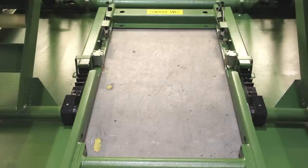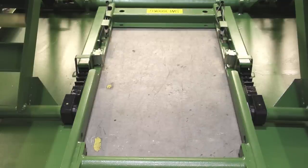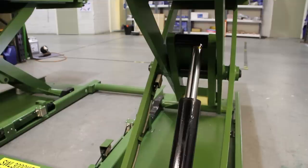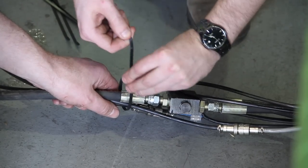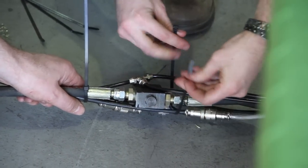We're now going to take you on a quick tour of the safety systems of a Clifton lift. You can see here on either base plate the locking ratchet system. On the ratchet you'll notice a couple of air actuators — these will raise the lock covers when the down button is pressed. To ensure the lift will only safely lower when both locks have been raised, there are two safety switches located behind the actuators. There's also a limit switch which cuts out the motor when the lift has reached its maximum height, and a sensor switch for the two-stage down system. You can tidy up the hose and cable assembly by employing a couple of cable ties.